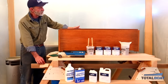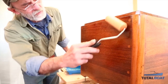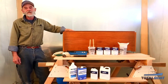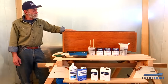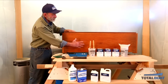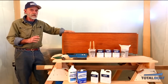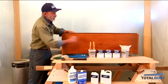I've vacuumed the room and cleaned the walls. I'm going to roll and tip this varnish on here myself, because the first five or six coats I put on I did with a brush. I had a little difficulty getting all the way around the box without a run or any little problems like that. I've got it prepped up very nicely now for that last coat. I want to make sure I can move around quickly and not get too much varnish in any one area — too much and this area could run, too little and you get dry spots over here.